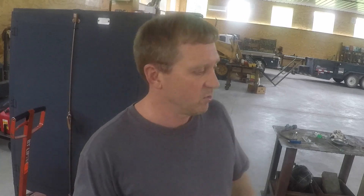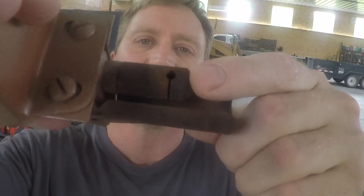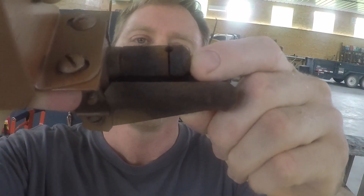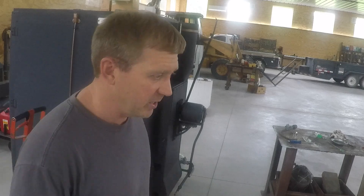So I can drill it out if I need to, but I haven't done it yet, and there's a good reason why. The pilot setup for this thing has a pretty big hole in it, and there's not really an orifice for this that you can change. So my pilot's going to be a little bit bigger than it needs to be. What I'm hoping is that with the too-large pilot but the smaller main burner orifice, I'll have a relatively controllable and decent working setup.